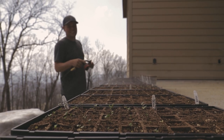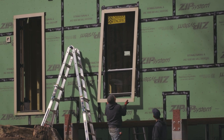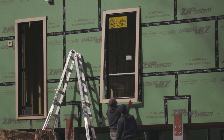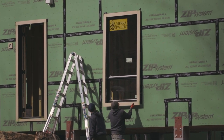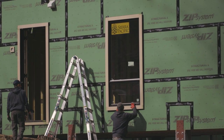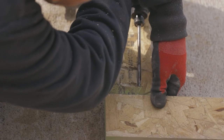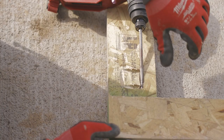So now onto the siding. We're not done with this yet, but we've made pretty significant progress on it. The first thing we did was frame around the windows and doors with 3.5-inch LP smart siding, 5/4 again. I pocket screwed and glued these. That way they were a little more solid and the joints weren't misaligned. So I made those first and then hung them up and nailed them in place.